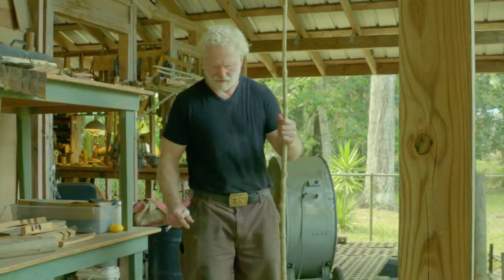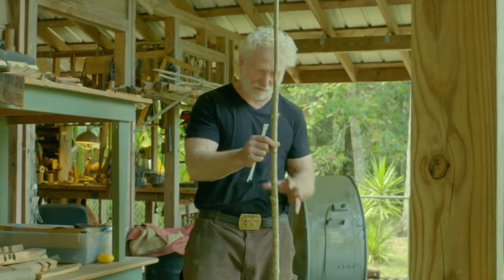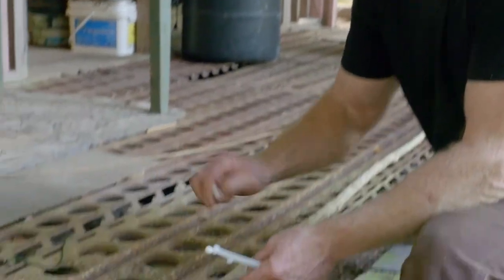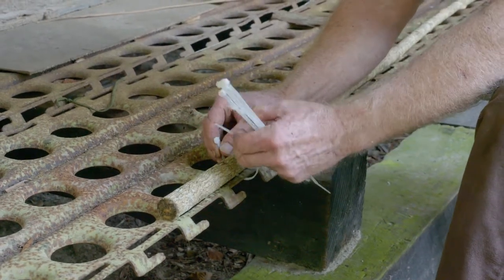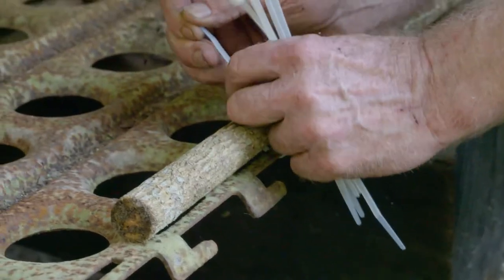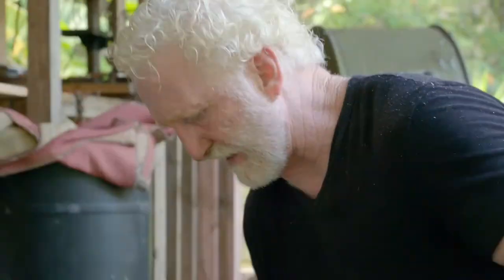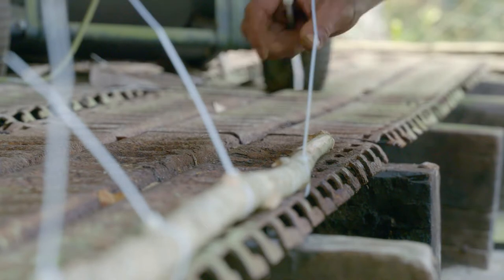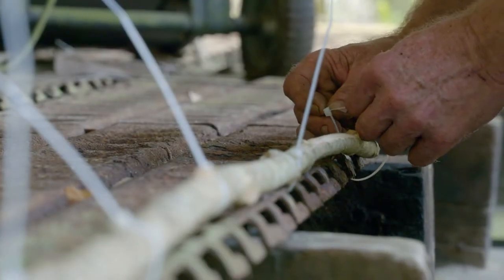There's a lot of ways to keep wood straight when it's green. If this would stay this way, I wouldn't have to do anything I'm fixing to do here. So what we'll do is use these holes — the big thick piece right there is probably not going to bend too much. You want to get it good and snug, pull that zip tie down tight. It's amazing how when green wood goes to dry, it'll do whatever it can to bend. See how that's going that way? I actually pull it back like that and zip tie it. That's how you straighten — by counter bending.